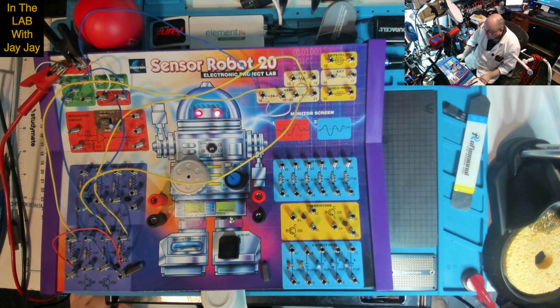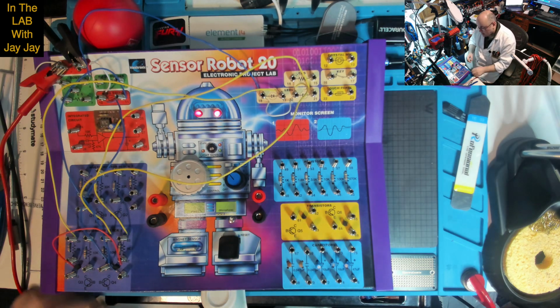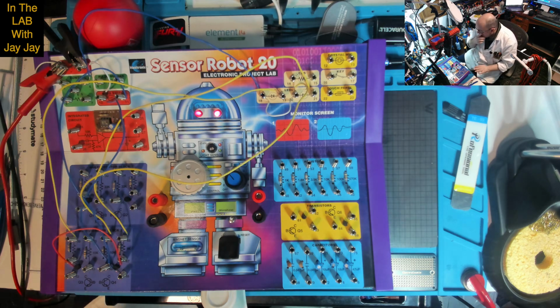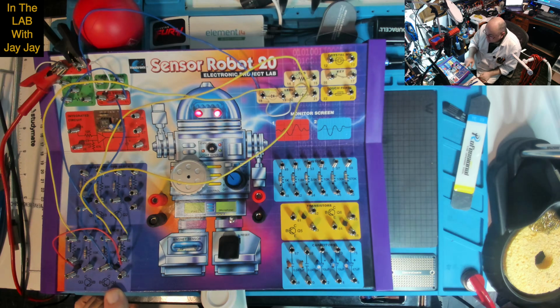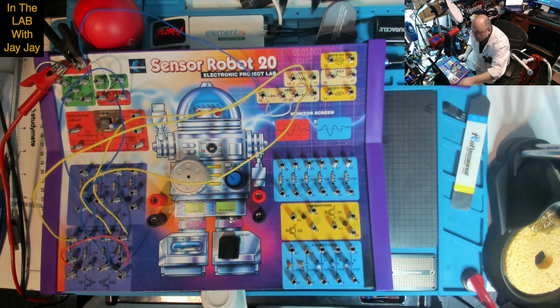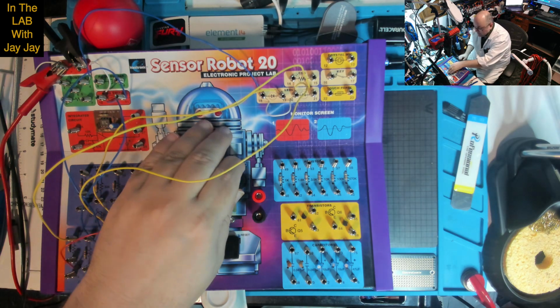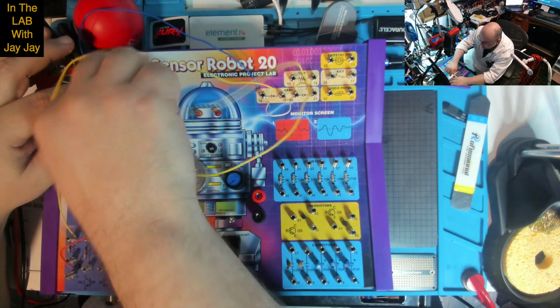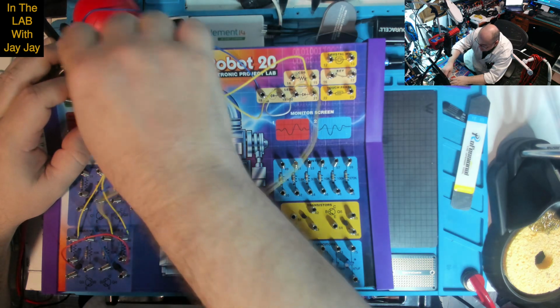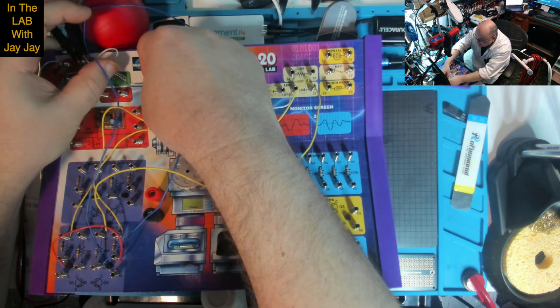Cool. Now the other thing that we wanted to just show, that you see the normally on state of this circuit is facilitated by this transistor here. What I want to show you is the continuity on the reed switch independent of the transistor. So what we'll do is, well, first of all, we'll disconnect the power. I'm just going to turn the power off, and we can leave that off as well. And let's just, for remembering, put the wires here, so we can put them back again later if we care to.